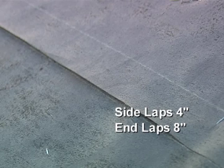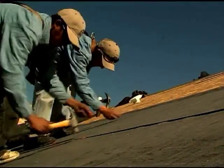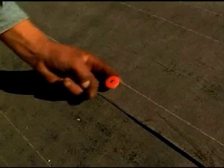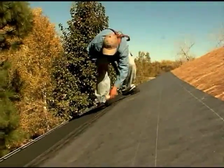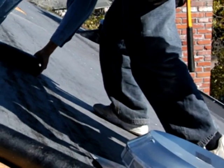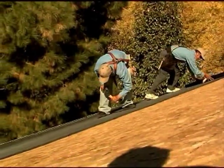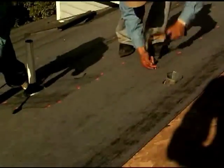Multiple end laps are to be offset from each other a minimum of 6 feet apart. EasyLay allows for the use of almost all common fasteners. You can use standard roofing nails with a minimum of 1 inch diameter plastic caps. For faster, easier application, you can also use staples when applied with a hammer tacker or pneumatic stapler. Consult your local codes for specific fastener requirements in your area. Walking on the EasyLay membrane, you'll notice that, wet or dry, it provides a slip-resistant surface, allowing for a safer, quicker installation. It is also very durable, resisting punctures and tears, and holding nails solidly.